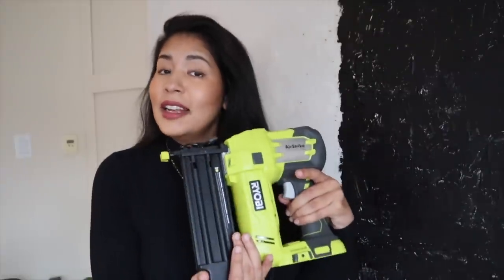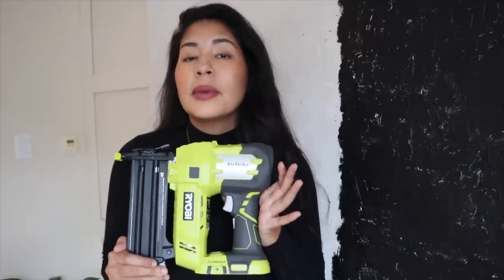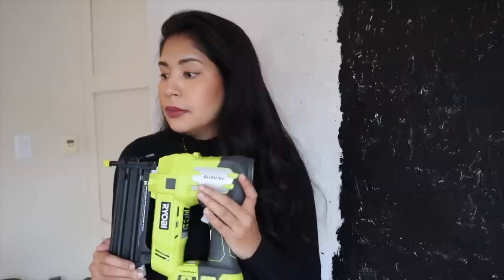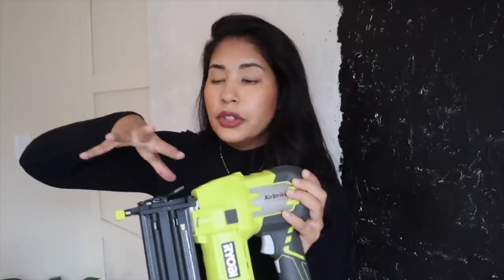Finally, you might end up wanting to nail some things together. For the first three years I used a hammer and a nail and adhesives, and that will take you a long way. However, if you're looking to do it faster and more effectively, you might need a brad nailer. This is the tool I used to build my balcony railing. It's also really helpful for refinishing furniture or doing wall treatments where you want to nail trim to the wall or to a furniture piece. I did not have this for the longest time, but it makes your job go much faster and easier. I was very intimidated to use it, but all you have to do is make sure your hand is nowhere near the tip while nailing, and wear eye protection and ear protection. The same goes for when you're working with a drill — tips can break, things can go flying. Make sure you're wearing your protection.